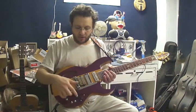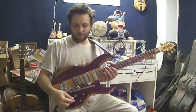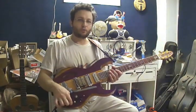Very cool sound. The volume pot is a 500K, the tone pot is a 100K, and it's got a 0.1 cap that's the old blue long cylindrical type. 5-way switching. I have a neck add switch right here to add the neck pickup with the bridge, and I have a 3-way mini toggle coil select switch for the bridge pickup.